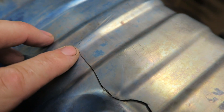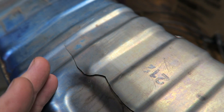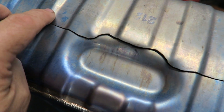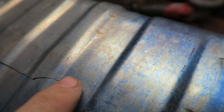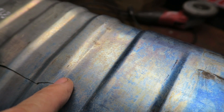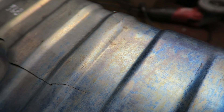One of the tricks here is to find the end of the crack and drill a small hole. That basically dissipates it from taking off in a direction. That one right there is pretty clear. Now this one has multiple cracks — you can catch it with your nail. Sometimes when you heat this up you can see it. We'll drill the hole here, put some heat in it, and that might just be a fracture on the top — but if not, we've got to drill a hole at the end.